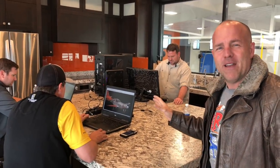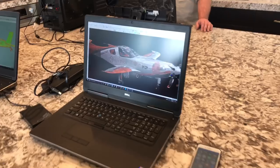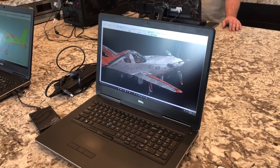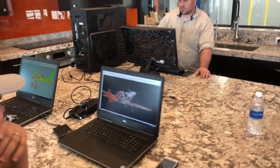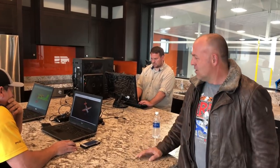What we've got going on today is three guys way smarter than me doing computer things. So on this screen right here, this is a 3D scan of Turbulence with millions of points. We can actually take that and cut it up into slices — take the plane, cut it up, turn it and look at any profile of the aircraft. We can also take it and put it into fluid dynamics or aviation software and then put it through the air at 300 knots, 400 knots. We can play with the wind and see what's happening with the aircraft at various speeds. What's nice is it's as I have built my airplane — not trying to interpolate what it was originally, but what it is today.